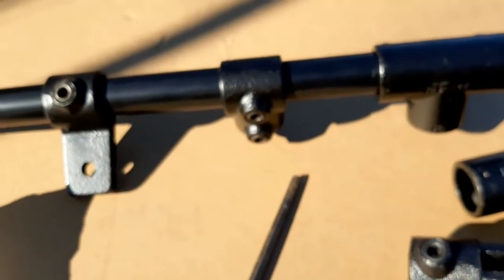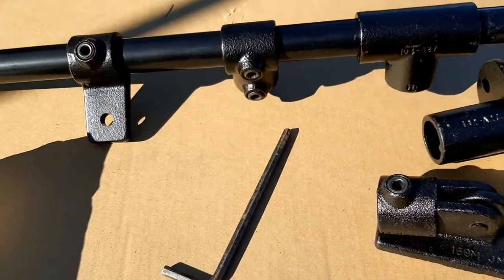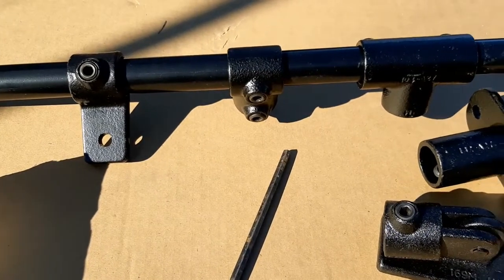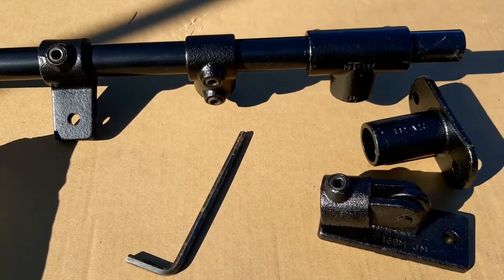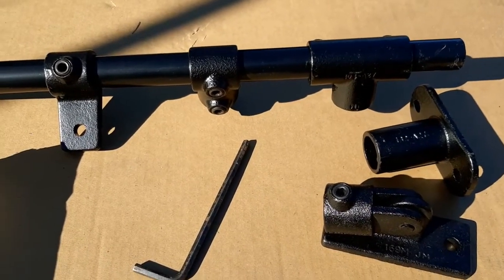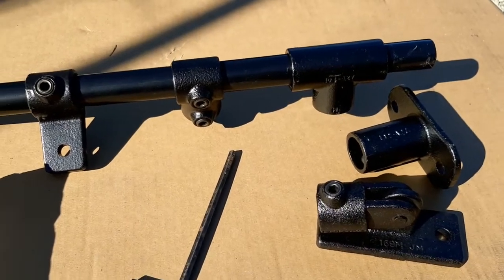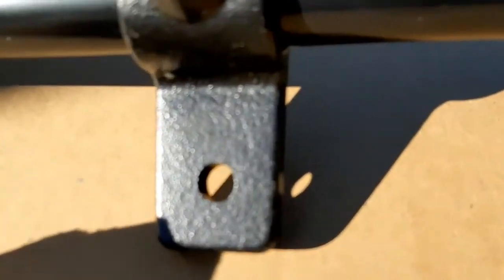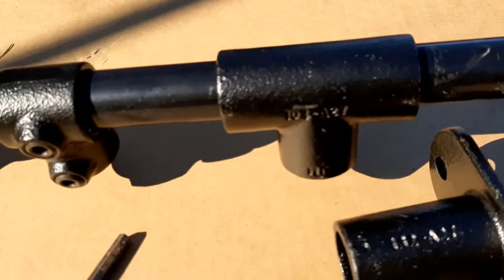It's also available in galvanized silver color, which would work well for the same purpose. I chose the black because I really don't like welding on galvanized steel — and I can also repaint it. If you're going to be welding on anything galvanized, you might need to grind off the galvanizing, and make sure it's well ventilated with fans. It's very toxic — you do not want to be welding on galvanized steel. This may be galvanized under the paint; I don't know yet, so I'm going to be careful. A lot of the parts are cast, and the steel is cold-rolled steel, so it's pretty strong.